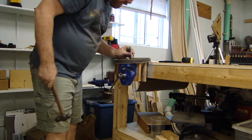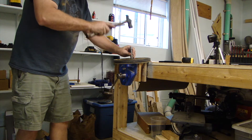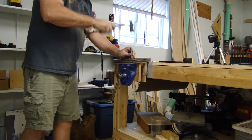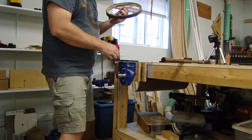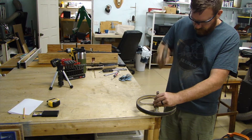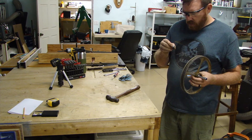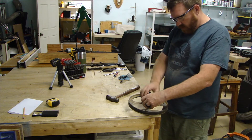This is the top wheel and there are two needle bearings inside that. I'm just using a socket and a little extension, popping that bearing out — it fits pretty neatly in that hole. The way that wheel was sitting on my wood vise wasn't very straight, so I decided to get another socket that would fit outside the OD of that needle bearing, and then I'm popping it through into that socket, because you've got to have something holding up the wheel but not in the way of the bearing. The socket is pretty handy for that.